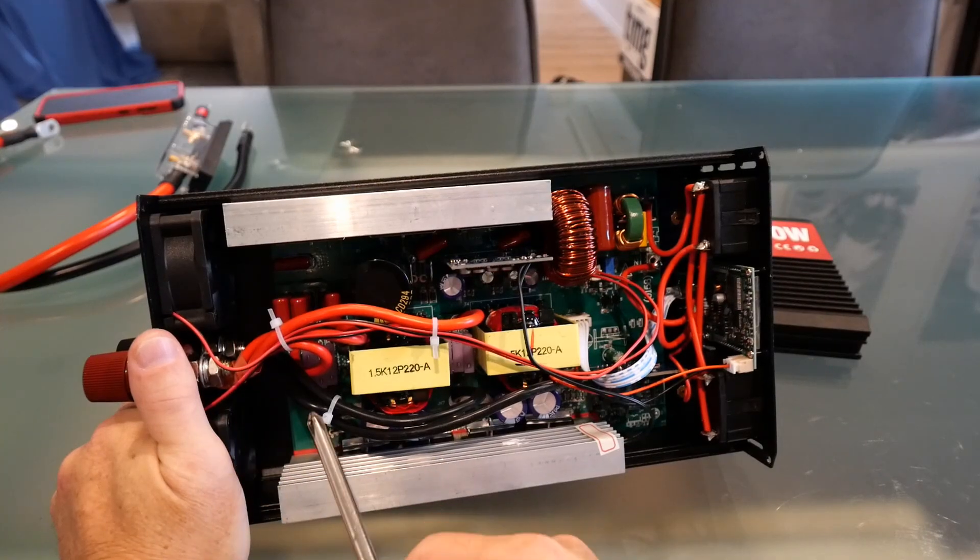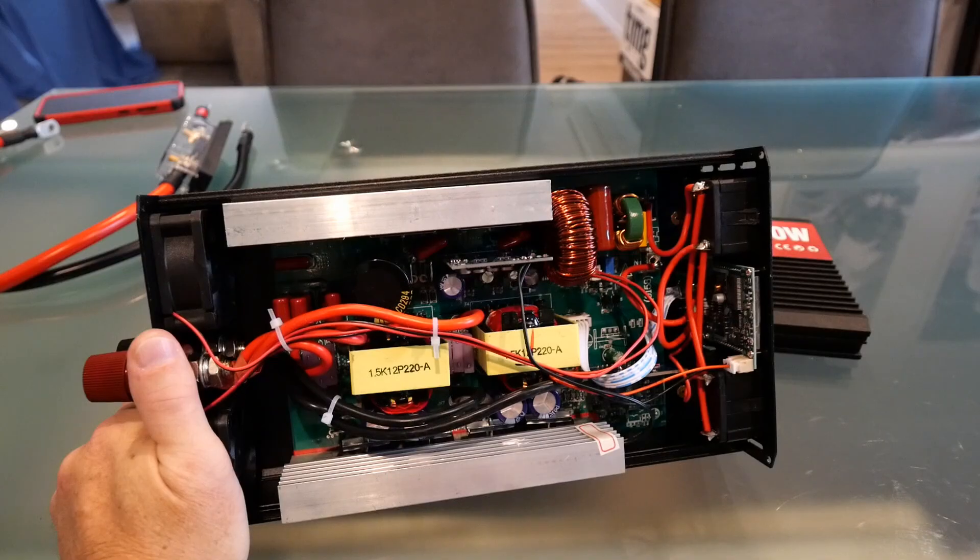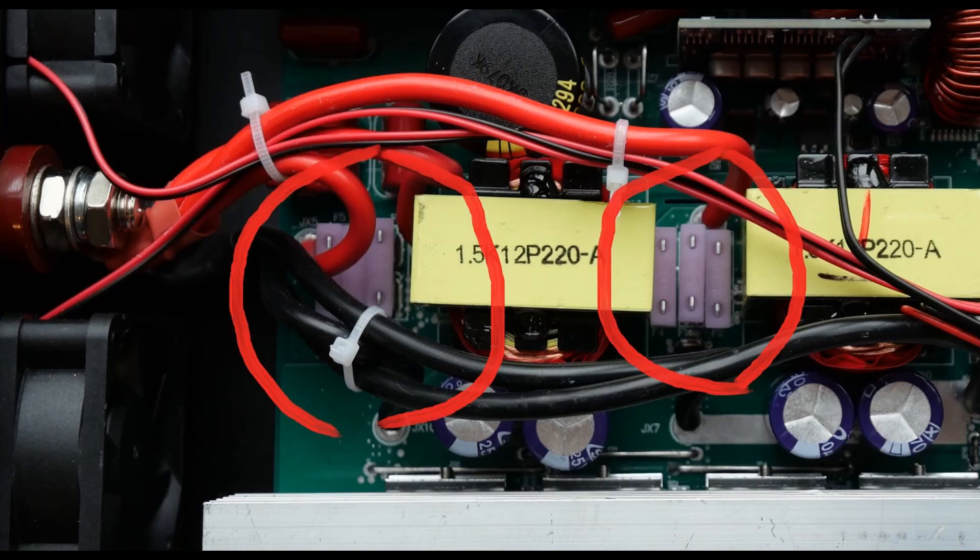Because those cables will get really hot. Looking closely inside the unit, I note there are two banks of three 50-amp fuses, so in theory it can handle a peak of 300 amps of current flow before those fuses blow. If you ever have a fault with a unit like this, it's worth checking inside for blown internal fuses — it's good to see they've built them in.